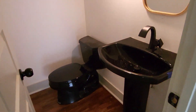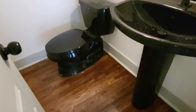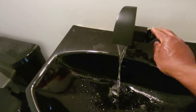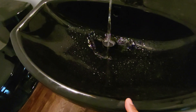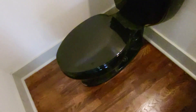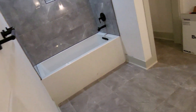This is a little half bath. At this point everything is already covered, so I'll run the water, check under the lavatory for any leaks, go over and flush the toilet, check for any leaks around the shutoff valve and the tank, and make sure it's sealed and caulked at the base of the water closet.